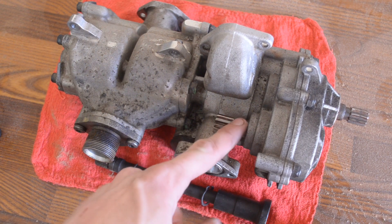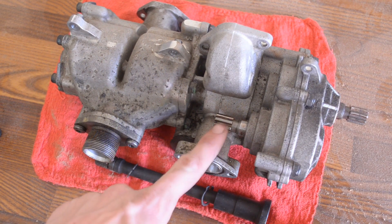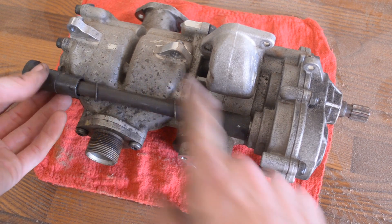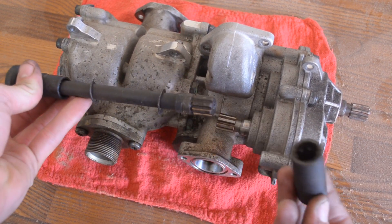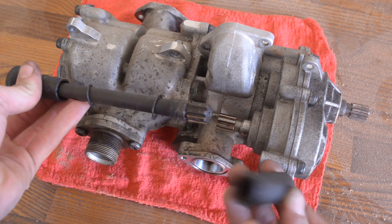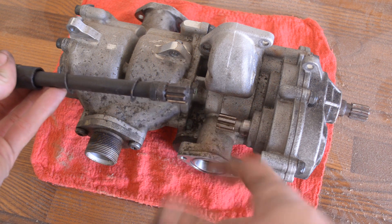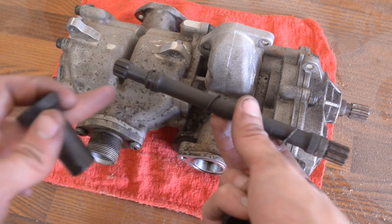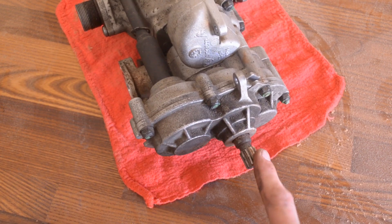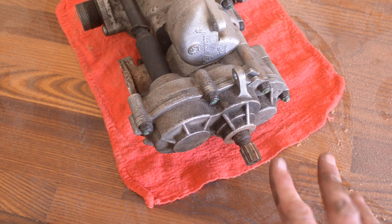Typically, you see oil leaking from these two shafts. This is the shaft coming from the accessory drive, and then this one drives the water pump. Thankfully, the shaft leading to the water pump usually doesn't corrode. You can see how it decouples, and these two couplers are spline drive. What I recommend is cleaning all this off, putting new grease on all of these couplers, and getting new snap rings. On every oil change, I'm going to pull this off and re-grease this shaft so it never seizes again.